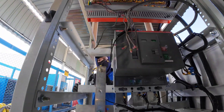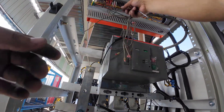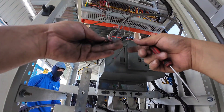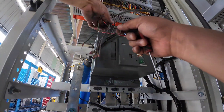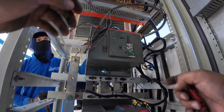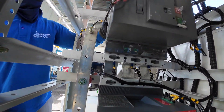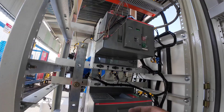Now as you can see here, we're doing the preparations for our connections to our generator site — for example, the start command, the voltage sensing, and so on. You can see we are busy with connections. Our bus sensing is connected below to our main breaker, which is wrong.